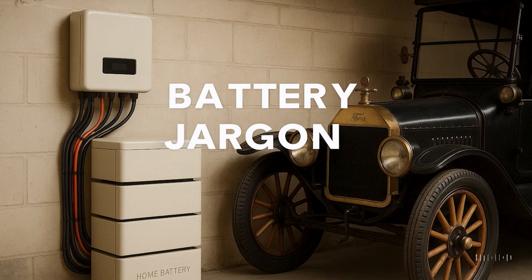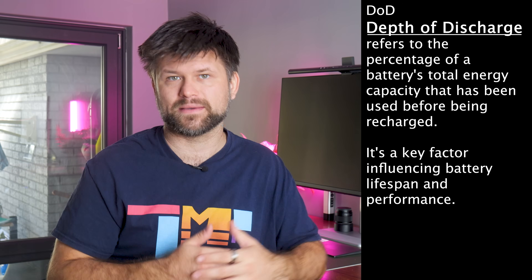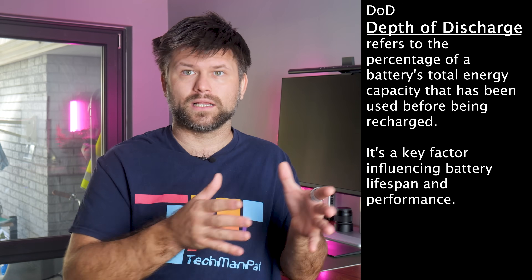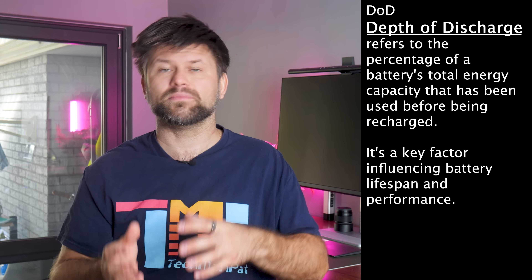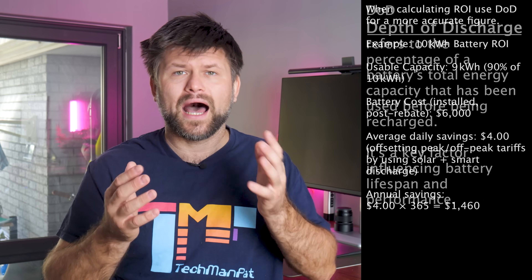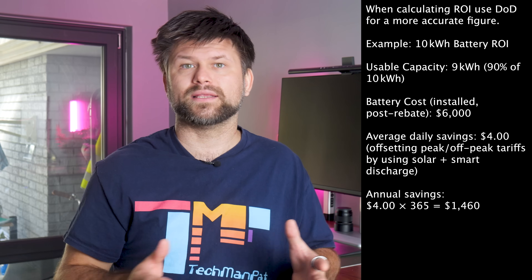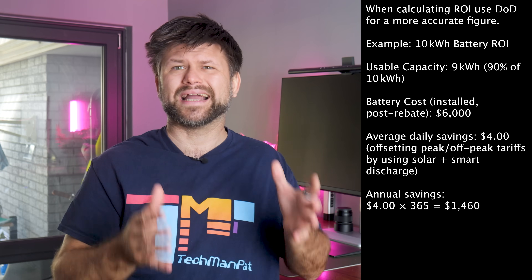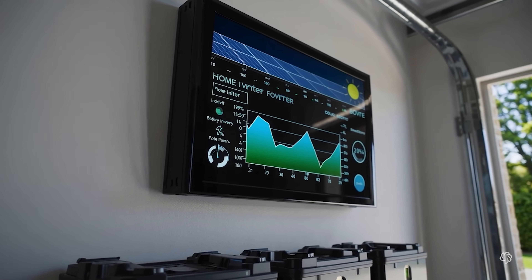Let's start with the battery jargon, to clear up two key tech terms you'll hear all the time. First of all, depth of discharge or DOD — this is about how much of a battery's capacity you can use. So if a battery is 10 kWh and has 80% DOD, you shouldn't draw more than 8 kWh from it before recharging. Using more could shorten its lifespan. A high DOD means you can use a larger slice of the battery pie. Many modern lithium-ion batteries boast around 90% DOD or even 100%, meaning you can use almost all the energy stored without worry.